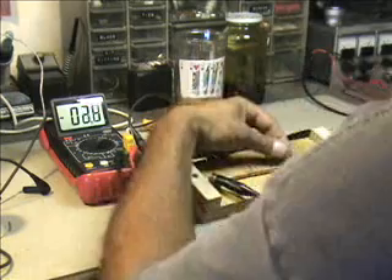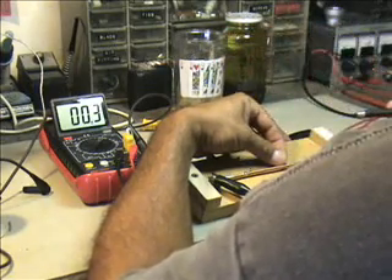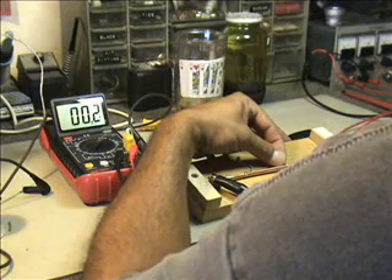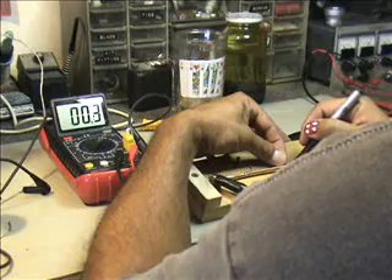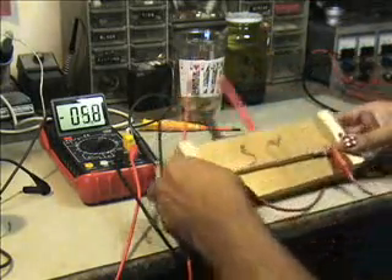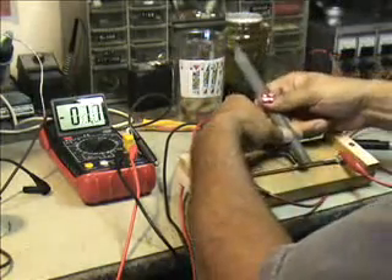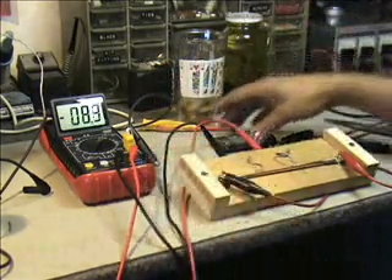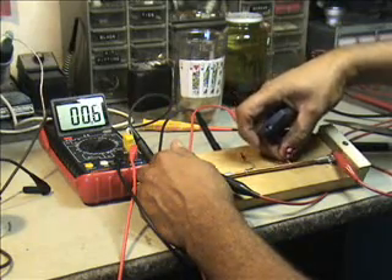Let me get my little marker. Go ahead and look at the voltmeter — move this over to where it just starts to go on. Since I have it set at three, that's obviously above three, so we'll move it down. There's flickering to two, so it's about 2.9 right there to three. I'm going to put this right here in the wood. We want to solder that wire right there. We'll go ahead and turn that off. We'll solder that right there. We are just going to do the same thing and solder this wire right here, just as we soldered that one.